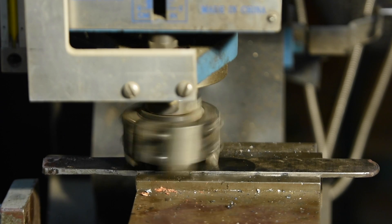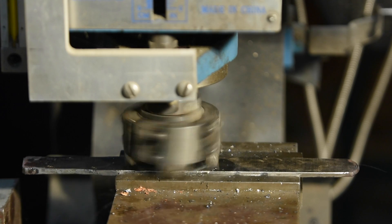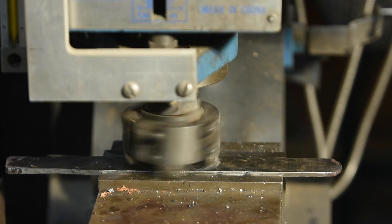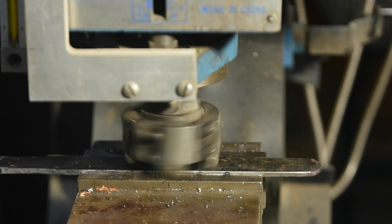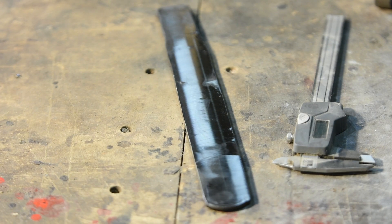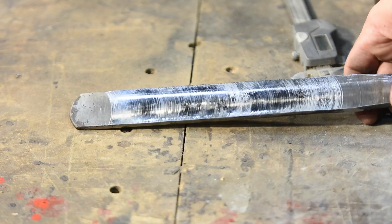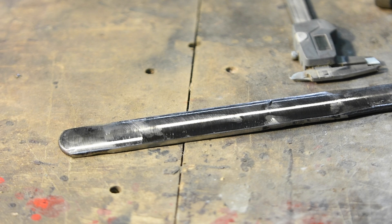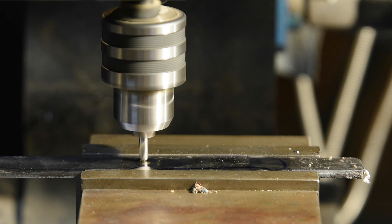There are a number of ways of flattening our steel bar, including using a belt grinder, a surface grinder, or a mill. Each has advantages and disadvantages, but in this case I'll use the mill. I'm running a fly cutter with carbide inserts to true up the surface of the billet. It's a fairly time-consuming process no matter how you do it. So after several days of work, less than 75% of the original material has survived, with the rest ground off, milled away, or scaled or fluxed away. Only after all of this work can conventional knife making begin.